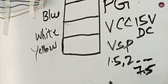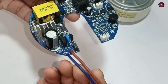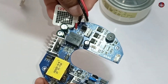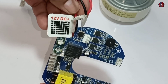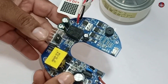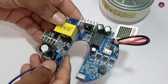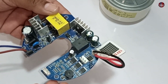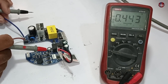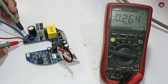As this device will be universal, it will operate all kinds of motors. This circuit has two sections: one section operates the circuit with 220 volts, and the other section is 12 volt DC, which operates the ceiling fan directly through solar panels. As I need 320 volts, 15 volts, 5 volts, and 7 to 8 volts, let's check if all these voltages are available in this circuit board. I have passed 220 volts through this circuit and will check the voltages on its main wires.